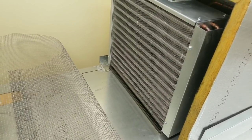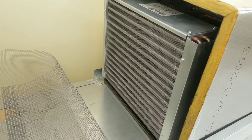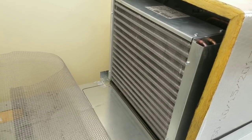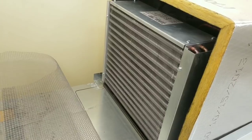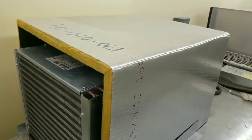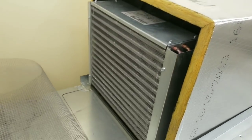We will be submitting a quote to install a drain line heater and installing a new pump for that condensate pump down at the bottom of the unit. And then we will be able to verify proper operation after that. All right. So I'll be talking to you guys when we return.